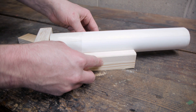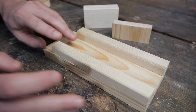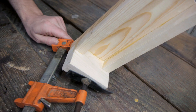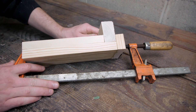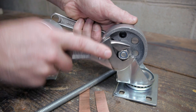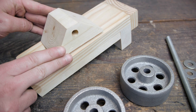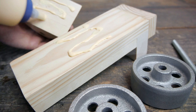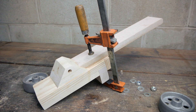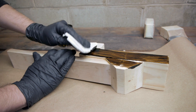Without knowing how well the barrel will fire, I decided it would still be worthwhile to make a fairly high quality stand, because I can always try mounting a different barrel to it later. A pair of side rails will keep the barrel from shifting off center, and most importantly a strong backing block is glued in place to absorb recoil. I glued yet another block behind that just to be sure it was strong enough. These iron caster wheels came from a local hardware store for about $5 each, and I think they have the perfect look for my cannon. Through this whole process I made quite a mess with my glue, so I spent some time sanding off my mistakes before applying stain and a clear coat.